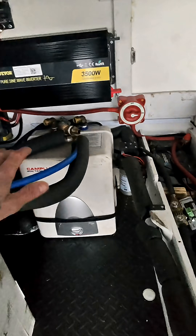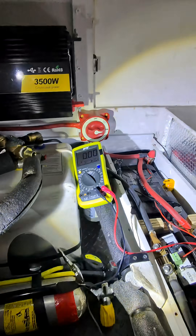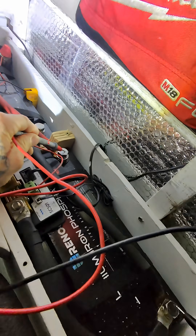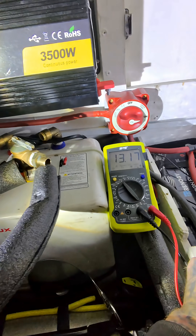The sun hasn't been out, it hasn't been beaming on the solar panels, and I haven't really been getting a good charge. So we're just going to go ahead and check the voltage on the battery terminals — positive there, negative there — we're at 13.17, 13.2 volts.